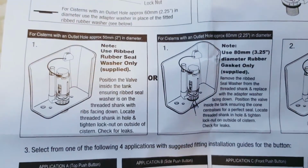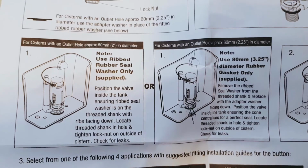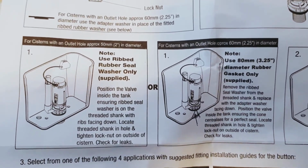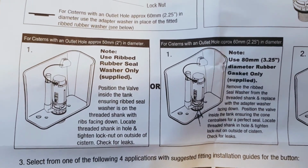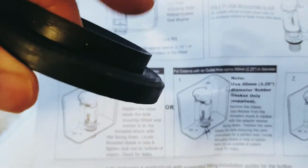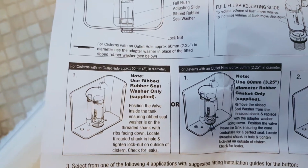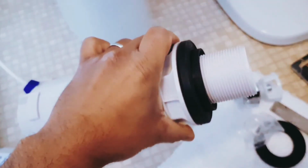Let me check. So it says remove the ribbed steel washer from the threaded shank and replace with the lip facing down. Position the valve. The cone centralizes for a perfect seal. Oh, they are talking about this cone then. Yeah. Locate threaded shank in the hole. Tighten it. Cool. So we'll do that, and we'll see you later.